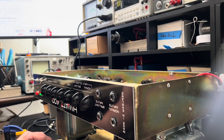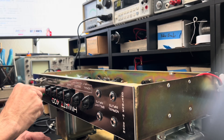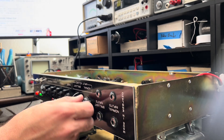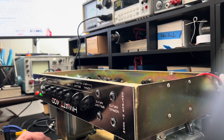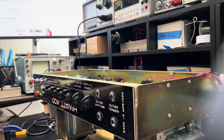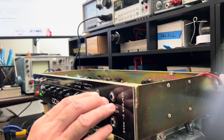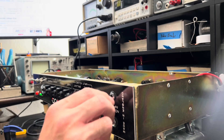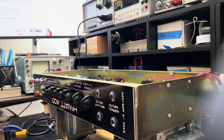We'll see if she wants to be stable, and it looks like she does. We're holding steady, so let's get our tone controls on 50%. Noise-free — she's noise-free on both channels. I like it. So outside of this, there's not much that I'm going to do. I'm not going to clean these pots out — they have that wonderful factory grease in there that I don't want to disturb. I'll clean out the inputs, take a look at the tube sockets and maybe give them a spritz. Tension feels nice, and then we'll just call it a day. I'll clean off that cab and get her set up.